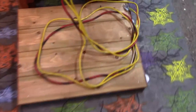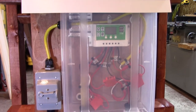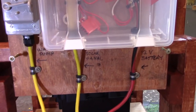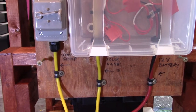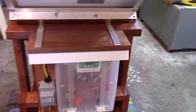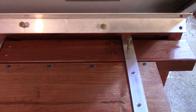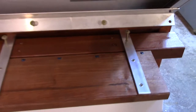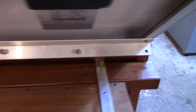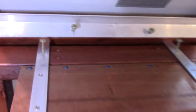Let's start off at the back end here. You can see I've got my wiring harness, and it comes up to my control panel — I showed how the control panel all went together before, and if you haven't seen that, I'll put a link down below for that video. You can see you've got the battery on the right, the middle is for the solar panel, and you've got the switch for the pump. I just put a couple of aluminum strips there, and I've got some beefy fasteners. All I did was attach the solar panel with a couple of pieces of aluminum angle, using these fasteners — and that should be no problem.